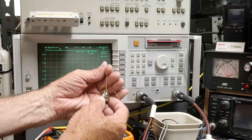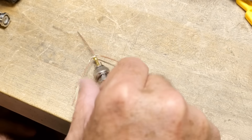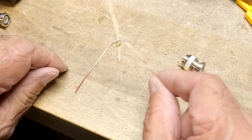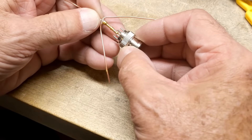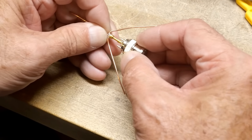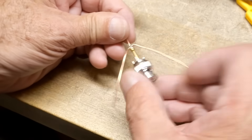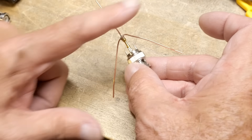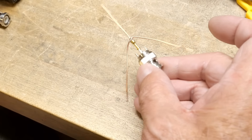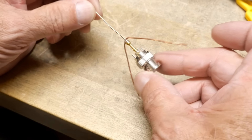So I made one — I decided to design my own. This is my attempt at a 1.2 gigahertz antenna. It's just this little piece of wire with a socket so I can stick it on the VNA. It's got this little radiator. I started with just the radiator but wasn't getting the results I wanted, so I added a little extra wire. Most of the time you'd put the extra wire on the ground side, but I have it on the conductor side. It's a kind of weird antenna — I don't think I've ever seen one that looks like that.